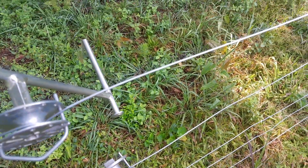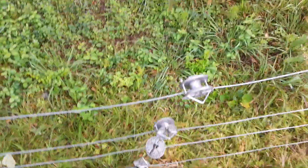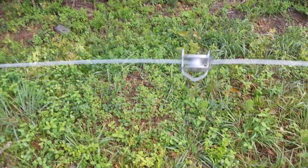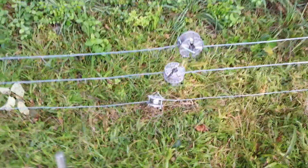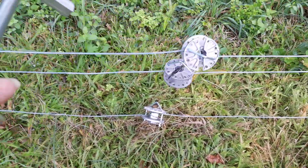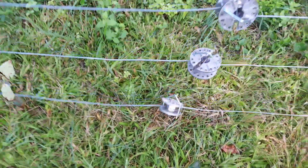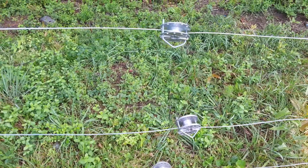I'm not going to get it super tight, but this is what I'm kind of looking for. If you notice, I'll just hit that fence and see how it wobbles in a big swing — same thing is true here with the second one. That branch came down to this third wire, but you can see how it bounces real fast — it's a lot tighter. I'll probably tighten all of those a little bit, but these top two need to be tightened because they look loose.